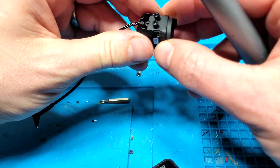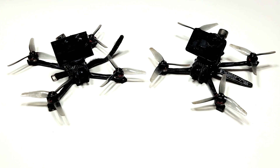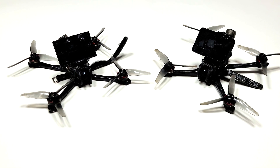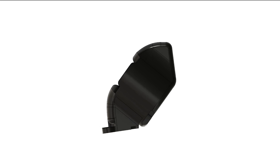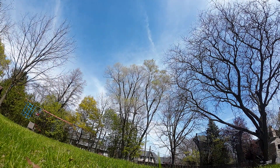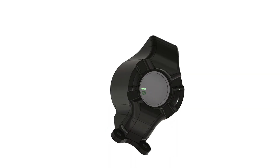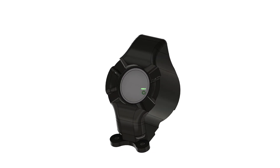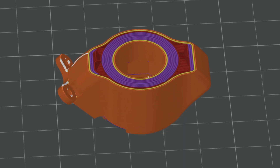Next came the camera. It is very easy to strip down and became smaller and lighter than I expected. To meet the soft-mount camera requirements with no props in view, I was inspired by my naked GoPro Scythe all-TPU mount design. I crafted a 45-degree armored housing that provided ample infill cushion around the camera to eat a direct crash, with a shape designed to encourage rolling on impact that also provided a top fin for easy turtle-mode crash recovery. I printed many iterations to maximize protection in front of the lens without being seen by the wide FOV camera, and determined the ideal infill to be 3D honeycomb at 7–8% infill density.